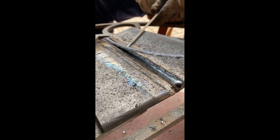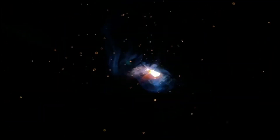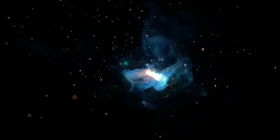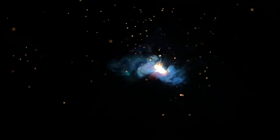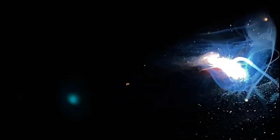Run done — another peel, easy clean, wire brush — moving on to the cap. For the cap we're going to follow that edge we've left, burning it away, giving us something to follow and keeping a nice straight edge. Maintaining our 15-degree angle, keeping that slag at the back, working our way down. Then same again: slight angle, half and half, laying up the side of that run, keeping as straight as we can.